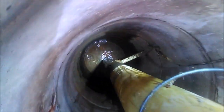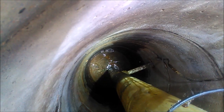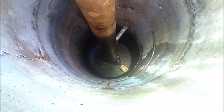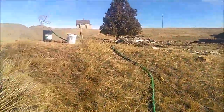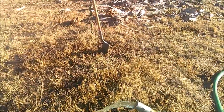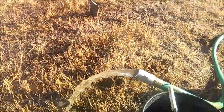The inside casing is just a little bit deeper than the sand level on the outside areas. The water is running out of the lateral and going down through the sand into the inside casing. Because this well can change its water level and production throughout the year, we're going to put a sump pump float switch in between the two casings. That way it will automatically adjust to however much the well is making. The well ended up making five gallons a minute, but we can put in a pump that makes more than that. It will take advantage of the storage and automatically turn itself on and off to match what the well is doing.